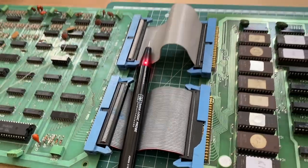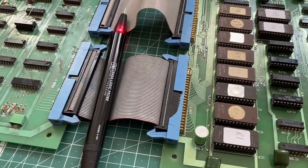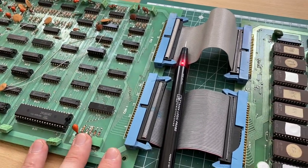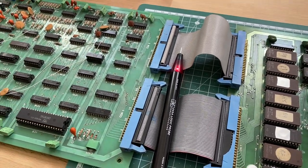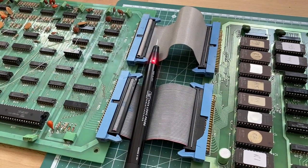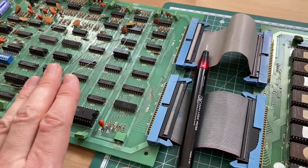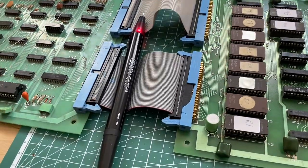So what it probably comes down to again, as with the previous Phoenix repair, we seem to have some sort of bus, so either address or data bus, or decoding problem. So even though the ICs are working, sort of, they do not seem to be able to communicate really, and this results in the CPU not really running the program that is on the EEPROMs.